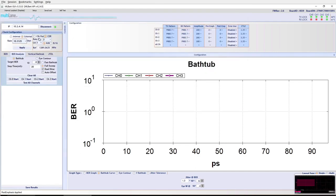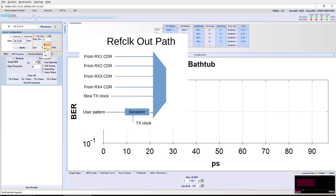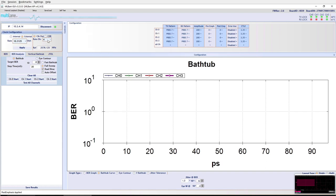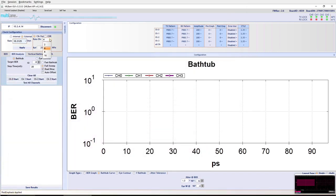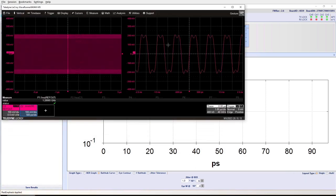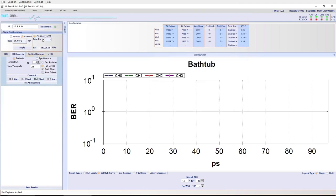Things get more interesting if we select clock out mode. We're now outputting the divided transmit clock using the SERDES mode on the ref clock mux. For example, selecting divide by 4, we are actually outputting a pattern of 0xCCCC — that's 11001100 — out of the reference clock port. On the scope view we can see 2.5 GHz as expected, though we're losing some harmonics since this is a 4 GHz scope. Selecting divide by 8 gives 1.2 GHz, as expected.